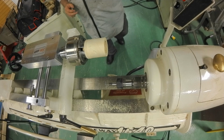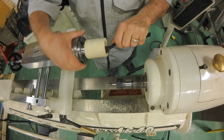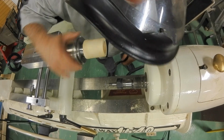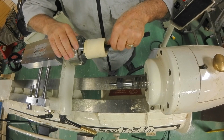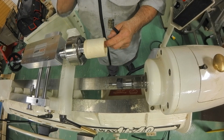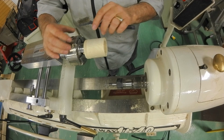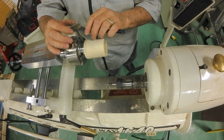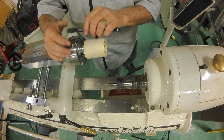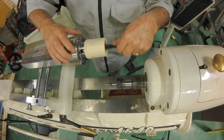Okay. I've got a small wire brush. Relatively clean. One point to note, I use a wire brush as well. Make sure it's a brass or plastic brush. Get some threads with a steel brush, and they all turn black. As soon as moisture gets in there, the metal of the steel turns a little black. Right? Brass works.